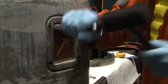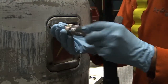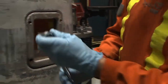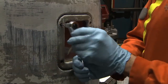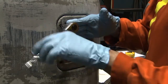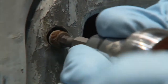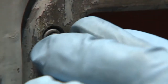The spring-loaded action inside the driver permits the direction of delivered force to be reversed if required. In this case, the screw is turned to the left when the mallet makes contact with the impact driver. When the screw has been loosened, the socket on the driver can be removed and attached to a regular ratchet, which can then be used to remove the screw entirely. Once unscrewed, pull it out of the hole and safely store it along with the washer.